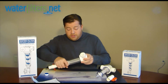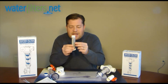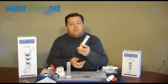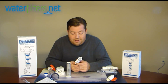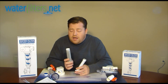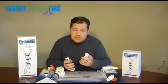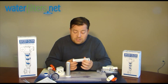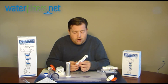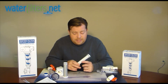You may have noticed that this trapper unit has a stainless steel element — the screen on the outside is stainless steel — whereas on this spin-down unit, the element is polyester, which is plastic. The only difference is that the stainless steel will withstand higher flow rates without the danger of the screen collapsing. I've not yet had anyone call and say their polyester element failed by collapsing, but they do wear out. Under high flow and high pressure situations, I'd recommend the stainless steel. For your average everyday run-of-the-mill application, the polyester will be fine.